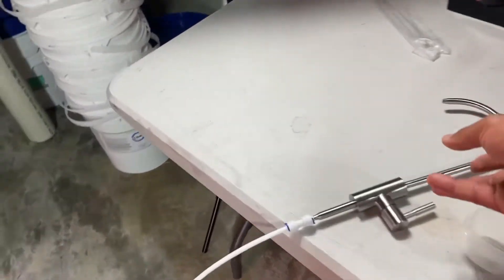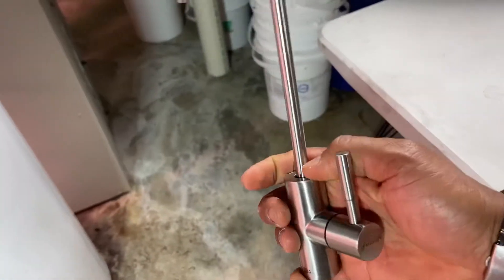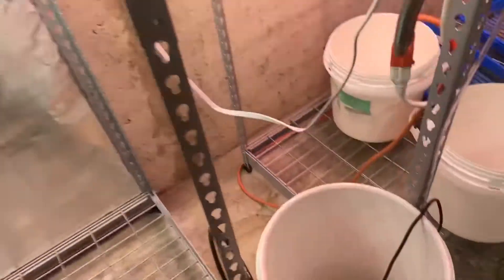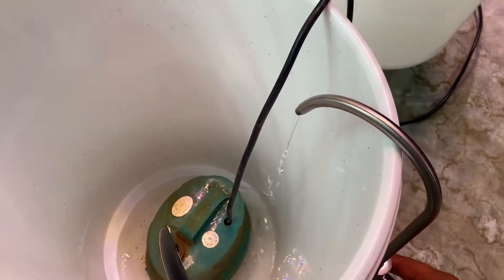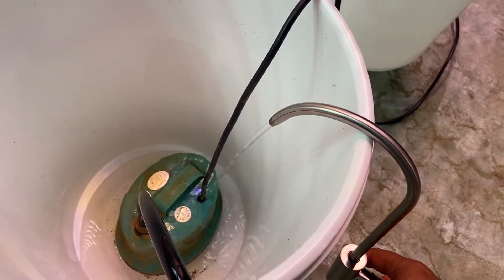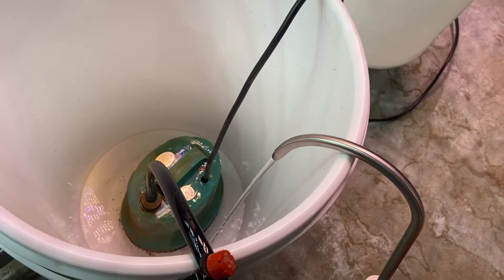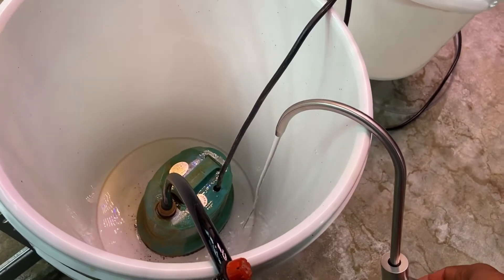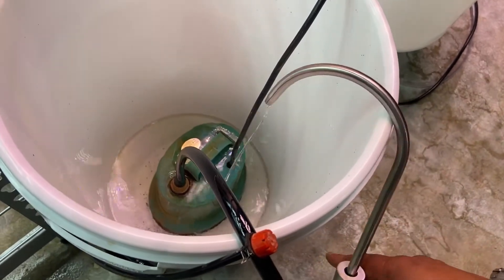Here is the faucet that you would need most of the time for hooking up to your kitchen, but you could just use it as-is. What I like about it is when I'm filling up hydroponics over here, I could just put it on the side and then turn it on. Let's check out the flow — it takes a few seconds to get up to full speed, and at full speed you're getting about a quarter gallon a minute, which is not bad for RO systems. It's a 1-to-1.5 ratio: for every one cup of RO water it makes, it makes 1.5 cups of wastewater, which goes down the drain.